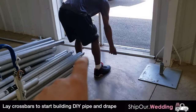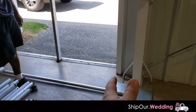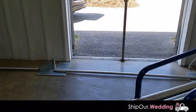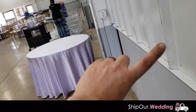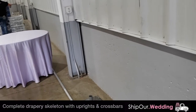The first step is to drop all of your crossbars like this. As we're going around, you'll notice we have some heavy base plates to lower the center of gravity and act as ballast through any egress ways — entrances for vendors, catering staff, entrance ways, hallways. You want to make sure it's a safe structure. We're dropping all of the crossbars and all of the base plates. The next step is to follow behind, put the uprights into the base plates, and start forming the skeleton — the base plates, the uprights, and the crossbar that connects them.